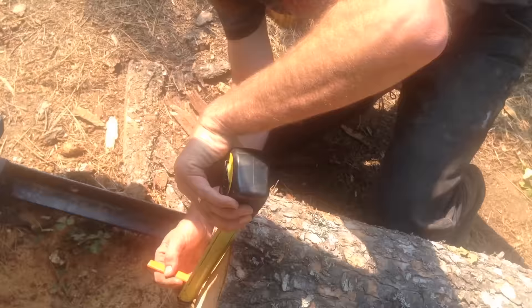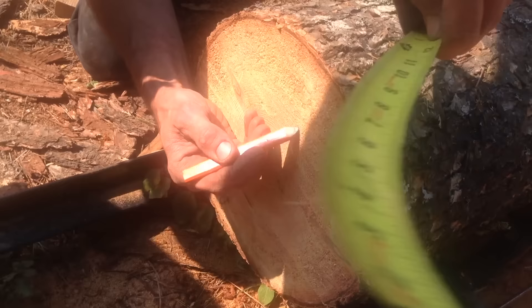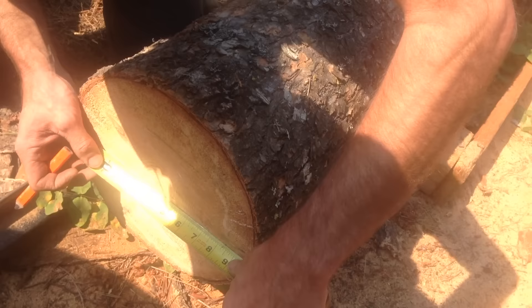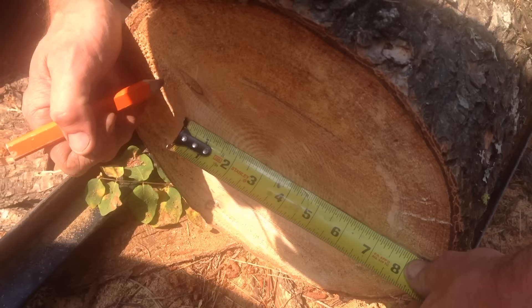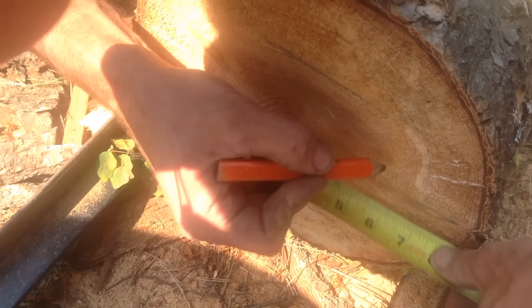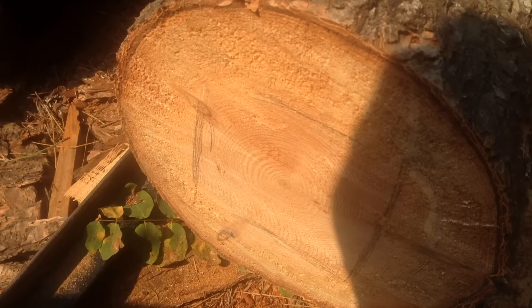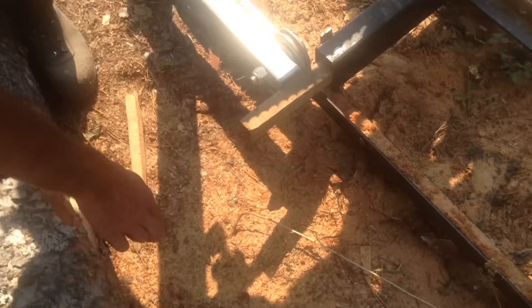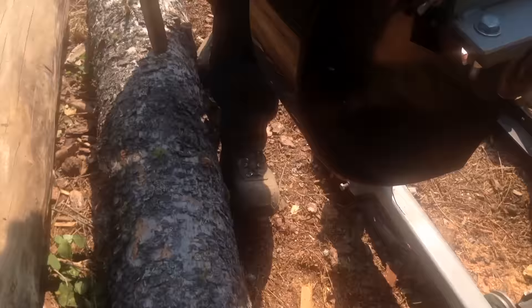With it sitting right where I want it to sit, I'm going to lay out the rough shape of my 6x6 relative to the center of the log. I just really rough it out so that I have a couple of marks to go by so I know roughly where to set the blade. Once it gets into setting final thickness, I make another mark. The reason why I mill it on center is that really the only way that it's going to deform as it dries is it'll twist, which is actually better than it taking a turn one way or the other. If you don't mill relatively on center as it dries, it will change shape in an uncontrolled way.